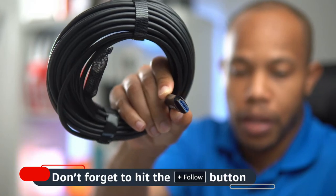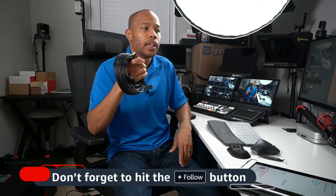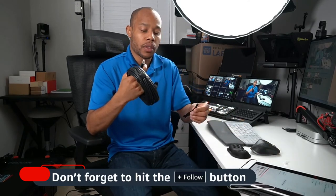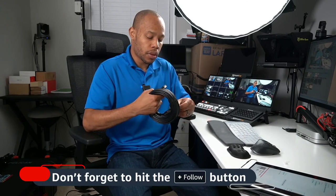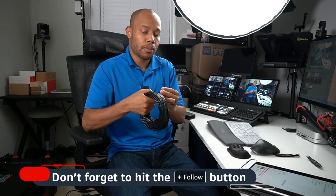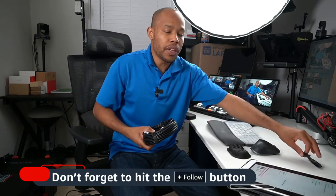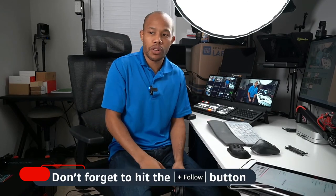You guys know that standard HDMI cable, right? Now, when you go past the 50 feet mark, you run into signal degradation. The signal is going to get weaker and weaker and weaker. So what I found out, the guy AJ, the CEO, he's on YouTube and creates a lot of cool content. He was talking about these fiber HDMI cables, which are one-way HDMI cables that you can run further than 50 feet. I tried it out and it worked. I was like, oh man, this is awesome, because after 50 feet you really can't use just HDMI. You have to use SDI cables and converter boxes.